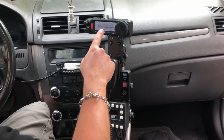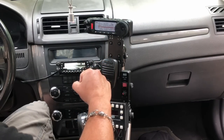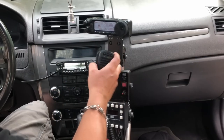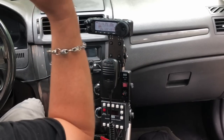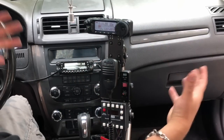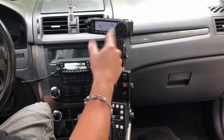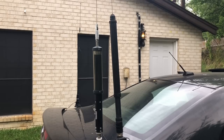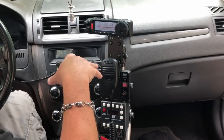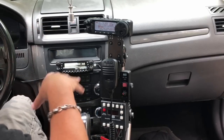It should just work. Push the tune button — it says high SWR, takes only a second. The antenna lowers because I had it tuned on 40. The SWR goes down and now it's tuned. If for some reason it doesn't work, I found that hitting the PTT can jump-start it. I was pushing the tune button, the ATS indicator was blinking but not actually doing anything — keying up got it working. From there, changing frequencies around 20, push tune, it goes again. Going to 40, push tune — done. Keep in mind you are sending out a carrier, so be mindful of other operators. This thing is awesome — it sends voltage through the coax, no extra wiring.